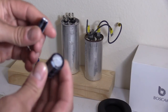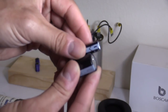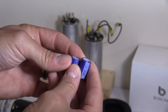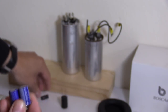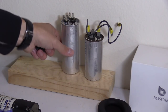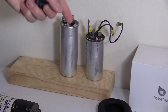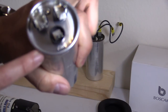Same thing goes for TVs — in a TV power supply you can feel the capacitors on top. These capacitors in a TV power supply are bulged on top, while brand new ones are flat. They're smaller but they hold voltage. If your fan outside doesn't move, doesn't turn on, or struggles to move, it's because the capacitor can't kick-start the fan. It needs to be replaced and then the fan will start moving. My outside fan wasn't turning on because of one bad capacitor, and this is a dual capacitor.